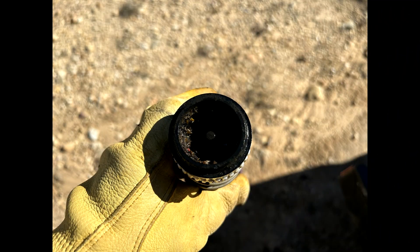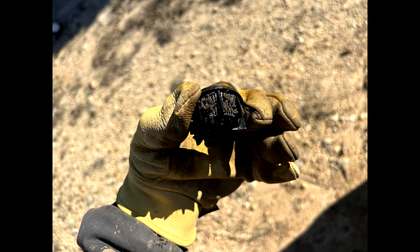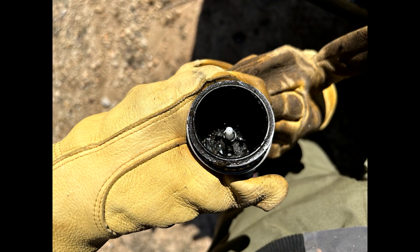The other sprinkler has a slightly different screen, but pulls out the same. This sprinkler, being the last of the two on the discharge line, had a slightly cleaner screen, but looking into the sprinkler where the screen sits, there's a coating of ice blocking the sprinkler.